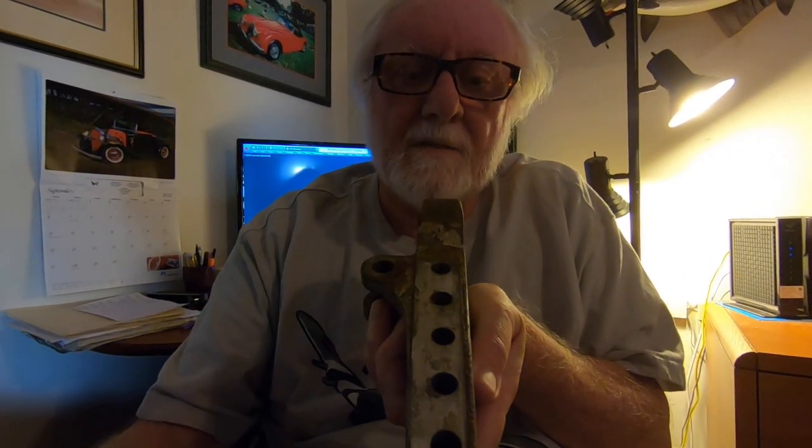There's one here that we discussed — this is the fitting off the wing, which attaches up into the fuselage pickup. Here's your pickup point. The wing spar goes out this way. What we do with these is, of course, we measure them and reverse engineer them and make a solid model of it. But if you look at this — the holes are well off centerline. We believe that these were actually drilled on the assembly. But there's no way I'm going to let a design go by like that, so we need to do some more research on the wing joint for that particular point.